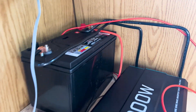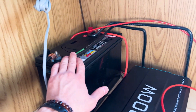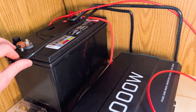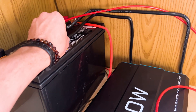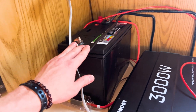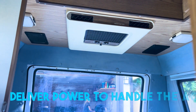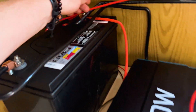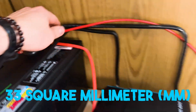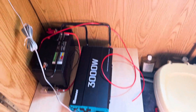So here's the in-house setup. We have the third battery and the 3000 watt inverter. Alex — my friend who's helping me with all of this — we had to buy this thick of a wire so the inverter and battery can deliver the power good enough to handle the AC. This is a 2 AWG size wire, 33 square millimeters. This looks pretty good here in the closet.